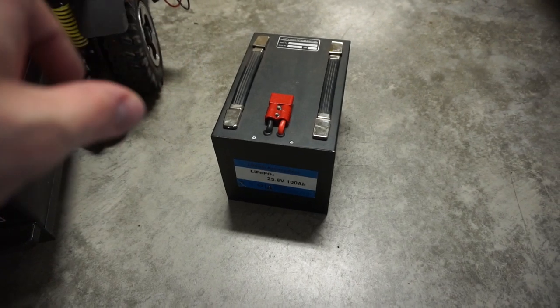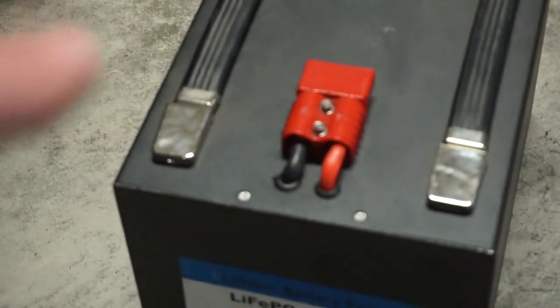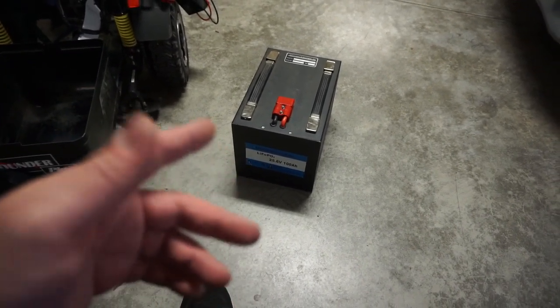There's no conformal coating or water ingress protection anywhere on this battery - you do not want to get this battery management controller wet. If any water gets in there you're going to have problems. Now granted there's a lot of circuit protection built in there, but that's the one thing you've got to be careful about. It would be nice to see some o-rings or other things on the end caps. Overall, I think this seems like a pretty decent thing. Hopefully this gives some of you information that you're looking for - there's been a lot of speculation around the internet as to what's actually going on in these things.